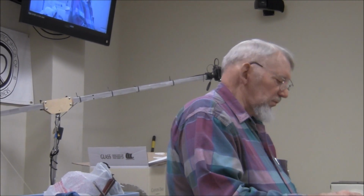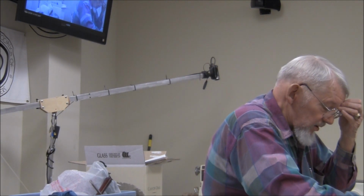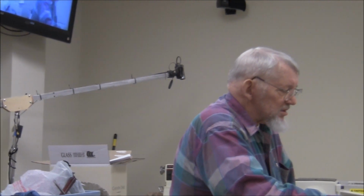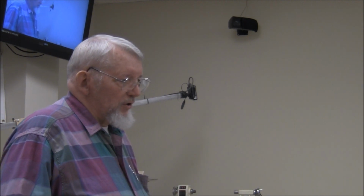And the other thing, drill rod. It's hard to beat that $2.60. Enco, and go in with somebody and get several. I've not used this, but drill rod is pretty accurate stuff, and it's typically available in 3-foot lengths. I say accurate in terms of diameter. And it's TG&P, turned, ground, and polished. Nice finish on that stuff. It comes in the anneal state, and it's O1 and W1. O is oil hardened, so you temper it in oil, and W you temper in water.